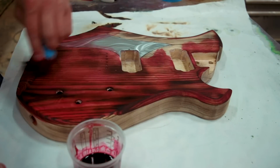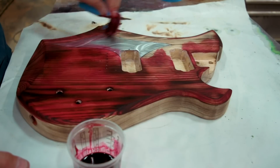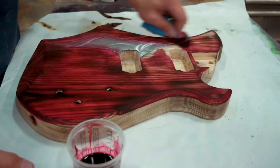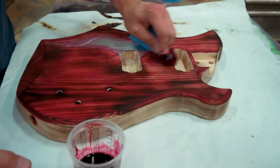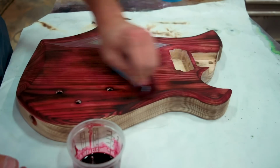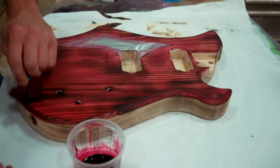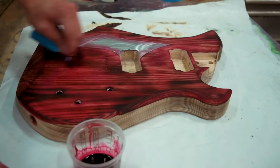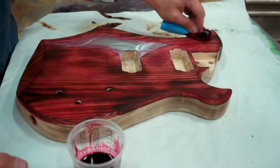Mostly it allowed me just a little bit more time and workability. This stuff is actually quite difficult to apply this way. It's not designed to be used like this. This is me kind of just being me and playing around with finishes in a way that they're maybe not meant to be used, but it's mostly a stain, kind of acting a little bit like a finish here, but because I've thinned it down significantly, it's working quite well.